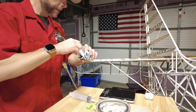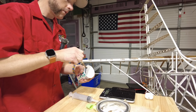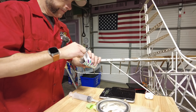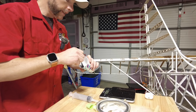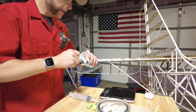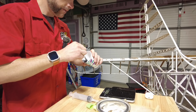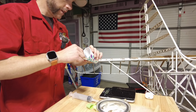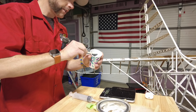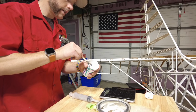I've talked about it probably ad nauseum, but in case this is your first video and you don't know what I'm talking about, if you put epoxy in one of these syringes, some people try to clean them out using chemicals, and I found if you just let the thing sit overnight, you can pull the plunger out in the morning and then lightly bend the tip and the syringe itself, and the epoxy will just break free from the syringe. Then you can drill a hole in the end of the epoxy plug that's in there, because otherwise it usually won't come out until you break that air seal on it. Put a sheetrock screw in it and pull it right out with a pair of pliers. Then you can reuse your syringe if you're into that. If not, throw it away.